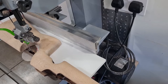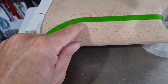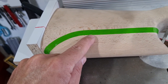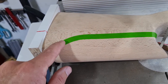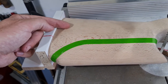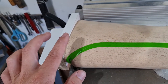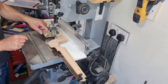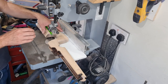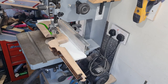The cheek piece looks fairly flat but it has a very gentle taper downwards, so once it's in the saw you'll see what I mean. The guide board runs along the bandsaw fence as the cut progresses; once I get to about here I'll stop the saw and freehand the last piece of the cut. I'll do the outside cut first so the cheek piece drops away, then come back and do the inside cut. If you've got screws in the backing piece, be very mindful of where they might go - you definitely don't want to clip a long screw with the blade.